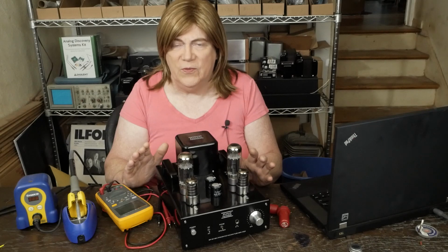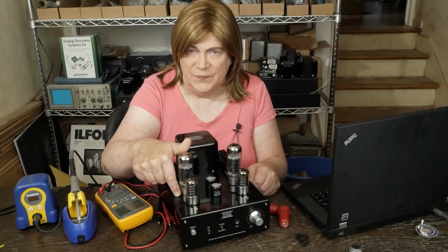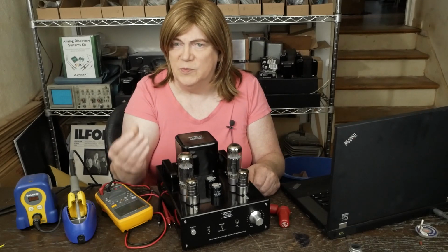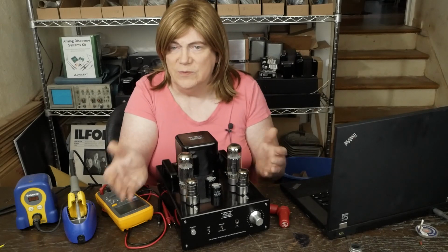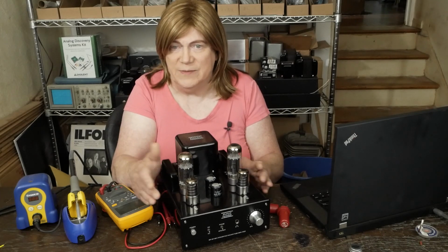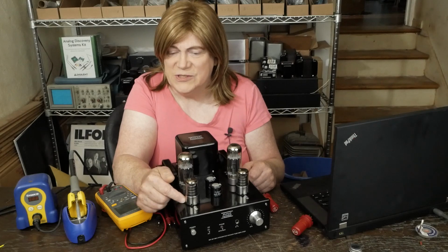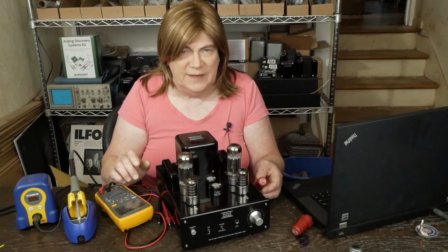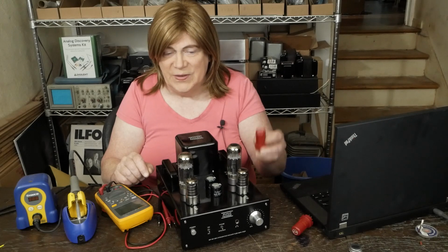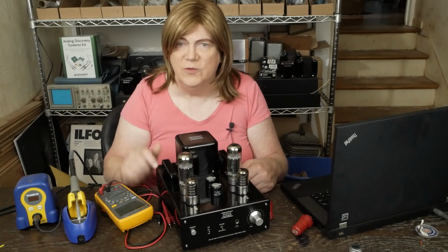I will say before I get into the video about tube rolling, these Horizon tubes sound really quiet. And I believe it's got something to do with the way the heaters are constructed and that there's no leakage between the heater insulation and the cathode, which some tubes there's a little leakage there and you hear some hum. So if you're looking for silence out of one of these amps, even unmodified, give a pair of these Horizon tubes a try. I like these Sylvania 6SJ7s just as a general all-around tube. If you need something that's a little brighter, these 5693 red RCAs work really well as well. I tried some mesh plate tubes, wasn't real crazy about them. Stock tubes, wasn't real crazy about them. So anyway, we'll get into tube rolling in the next video.